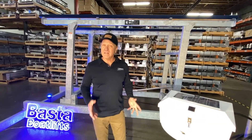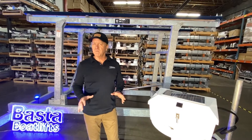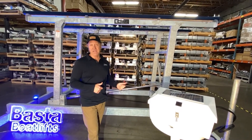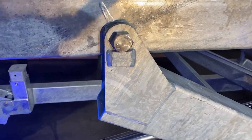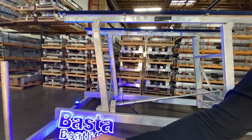Galvanized steel weighs about twice as much as an aluminum lift with the same capacity. All of our lifts come with fully housed bushings. The 8,000 pound lift has eight fully housed bushings at every pivot point — that's the four contacts at the bunks and the four contacts at the lower side beams. So when you're lifting or launching your boat, you're going to have the most stable lift and launch.